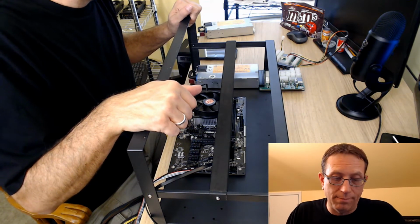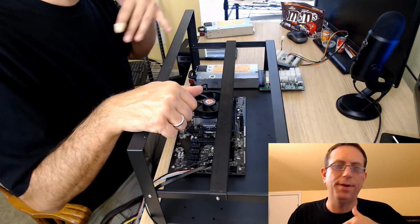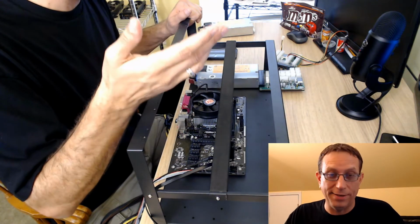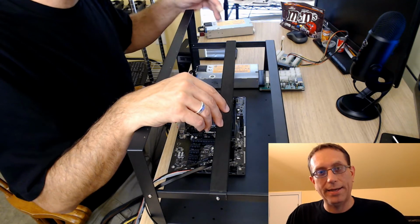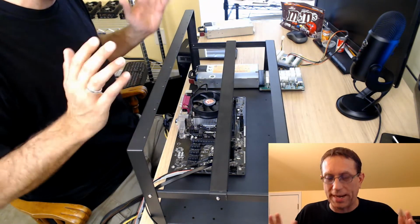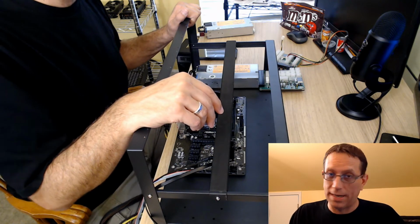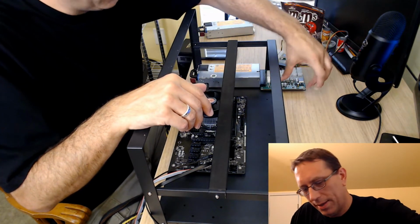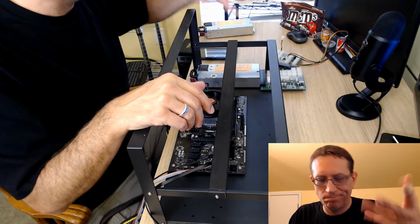Like I said, for this power supply, I appreciate the HP power supply because it's meant to run every day, all day, 24 hours a day, all year long. And other power supplies, some of them are meant to do that, and some aren't. They're meant to be just used casually. So if you buy a cheap power supply because you just want to get up and running and then you're mining with it, and you fall into the problems that I had where I'm burning out wires and could have potentially burnt out cords, and I was stupid enough to continue to use it and just move wires over and hope for the best. I've learned my lesson by luck with that one. So this thing is meant to run all the time. So I'll tell you what, this thing's sticking out another 4 inches, okay, right here, for something that's meant to do what this is supposed to do. I'll take it.